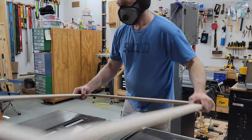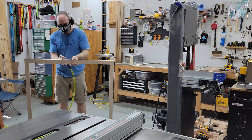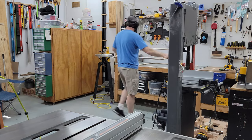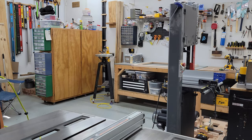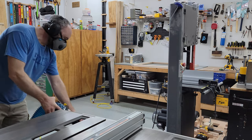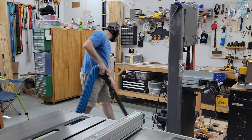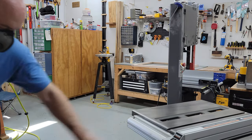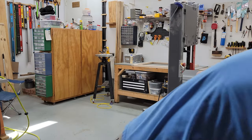It was almost time for finishing, but the main enemy of any finishing job is airborne contaminants, usually dust. That's also usually the thing that you make a lot of right before finishing, so I spent the next hour with the air compressor, dust collection system, and air filtration unit running while I tried to remove any potentially problematic speck of dust from my workshop, which is kind of like trying to remove all the nasty from a septic tank. I don't have a dedicated spray booth, and even if I did have one, I don't have a good place to set one up.